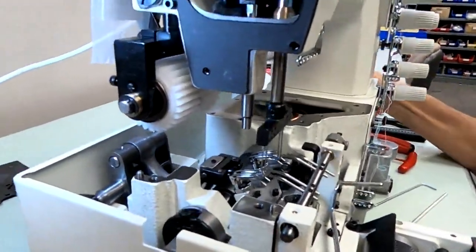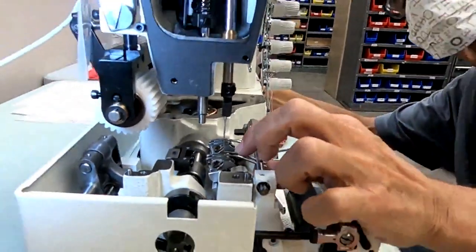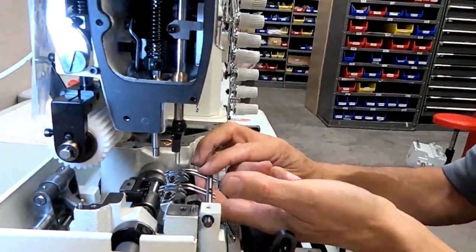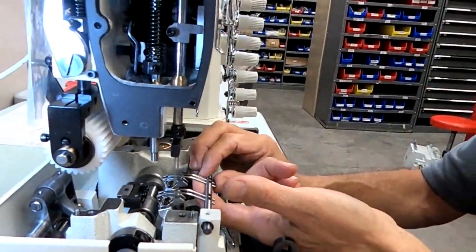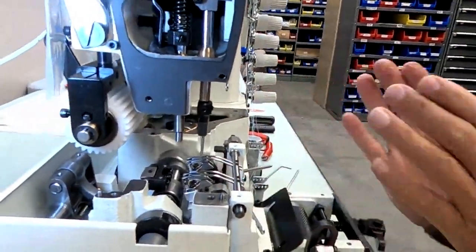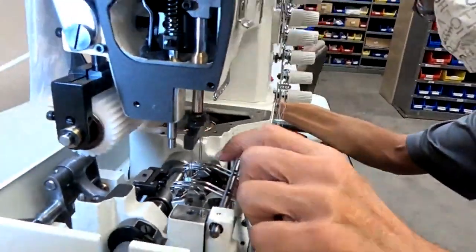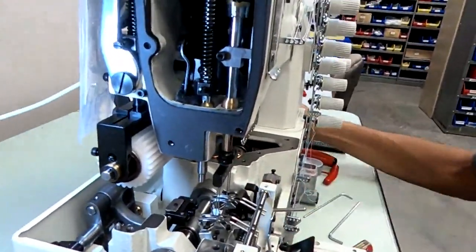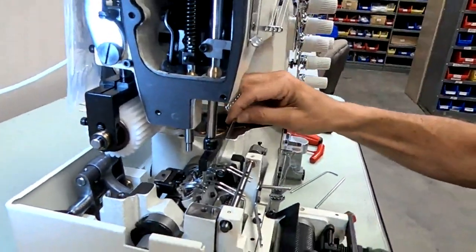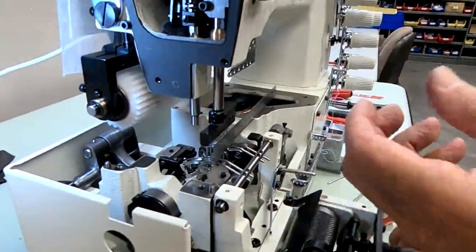Now I want to come back again over the top. You see the distance. Okay. It probably has to come down just a little bit, but it's close enough to where we can now set all 4 spreaders. Now we still haven't done the left to right position, but we're close enough now where I can set all 4 spreaders and then fine tune this. Okay, so needle's all the way down. 1/2 millimeter gauge, we're parallel again. I'm going to set the distance on all 4 spreaders.